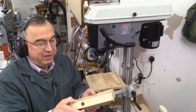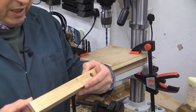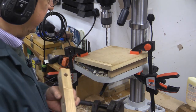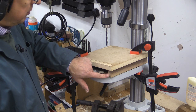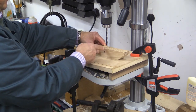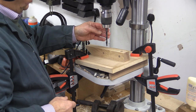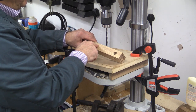You should now have an 18 and an 18 and a 15 and a 15. For the 8mm holes in the other two positions, we've got to allow for the threaded bar which passes through there to be able to move from side to side, and that means drilling at an angle. I've put a little block of wood under my sacrificial piece, and I'm drilling one from each side so the two 8mm holes are separate from each other but meet just in the middle.